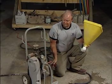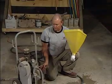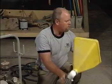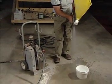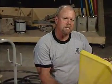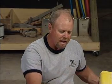Let's show you how it works. One last tip before we do that: it's not a bad idea to make sure that it's spraying properly. One way I'll do that is I'll put water in here. You'll hear it turn on — that's normal. I'll hook it up, put a little bit of water in there, and spray it down. That's not a bad idea because what we've done, in essence, is we've primed our unit. We've pre-wet the whole hopper and we've wet the actual gun itself, so now when we put our cement-based spray-down system in, it's going to pass through the gun very efficiently.